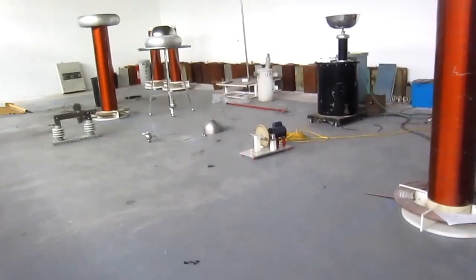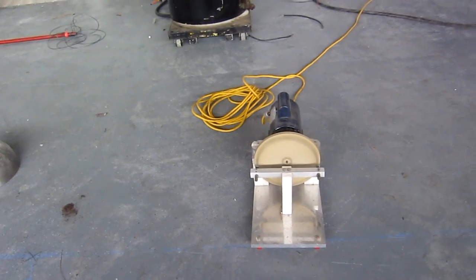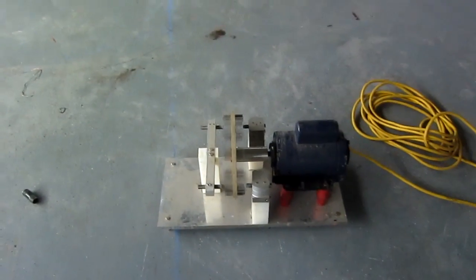There she goes — gap is on, running happily. It's not quite level and has a bit of vibration, but we never notice that when it's running because of the other noise in the room. It still has the thermal issue it used to, so it'll only work for short runs and needs some love and attention. But it's enough to get the system up, running, and tuned. We'll build a new gap in our brand new machine shop arriving any minute. Lightning is just around the corner!